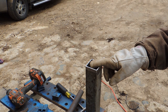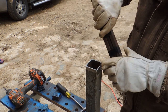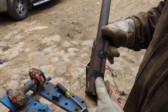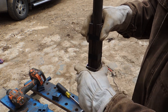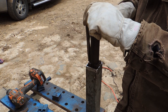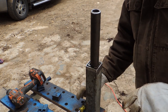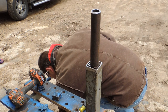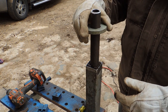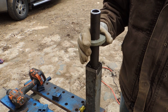So with this one I drilled a hole about four inches down so that I can at least somehow weld this when it's inside. I've wrapped some tape on here — you can see I got my washers tacked — there are some little bits of weld that are proud of the washer that make it fit fairly snug. We're gonna end up with something about like that, and then I'll be able to tap those down just a little bit, weld through these holes on either side, and cap it off for a smooth bearing surface.